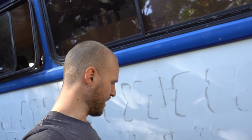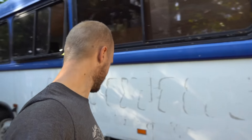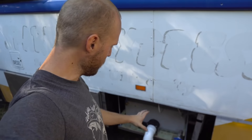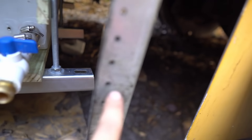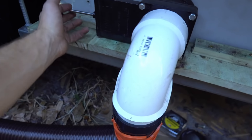Minor adjustment to the plumbing — I'm patching the wall here. We needed to access our plumbing and were going to have to cut in an access door, but I didn't love how that looked cosmetically and couldn't find any I liked. I've made just enough space to add this elbow — this little guy is right in there and it clears the wall. I'm going to glue in this and this. It's a good long term solution — you won't be able to open a door and access this, but you will be able to make the hose connection from underneath and pull the handle.